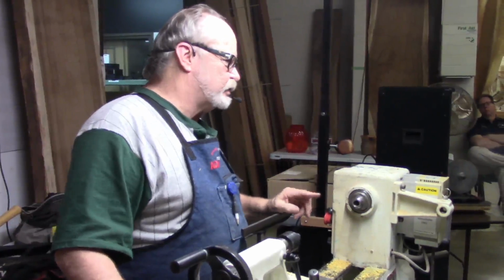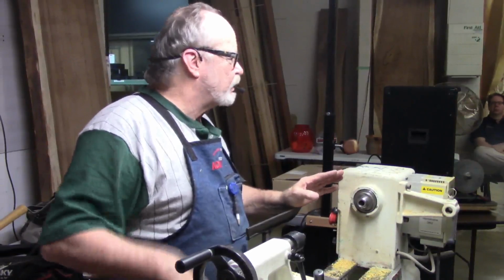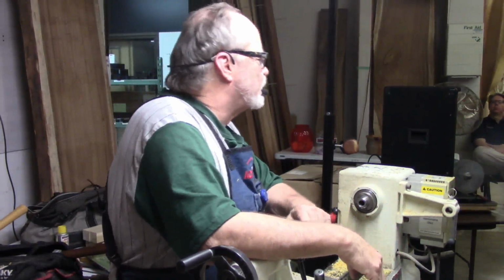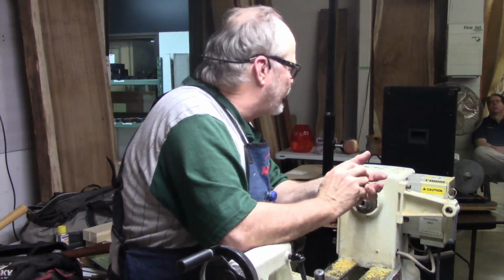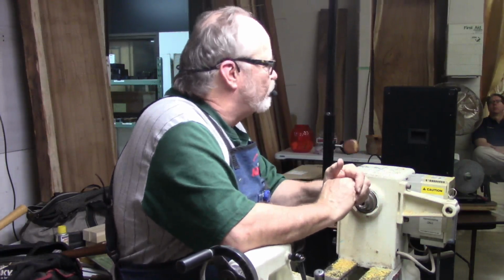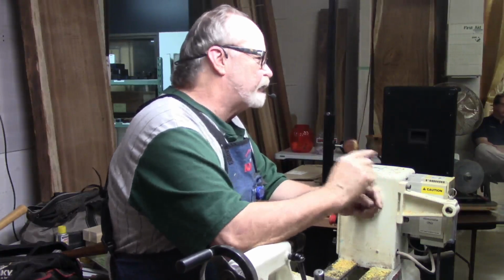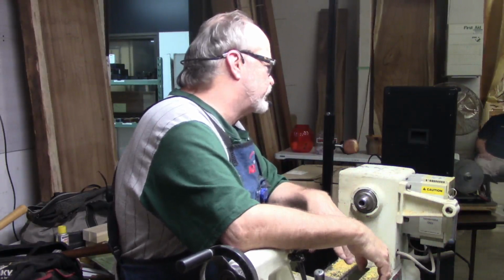It maintains the edge. I watched a professional bowl turner at a conference a few years ago. They asked him in the audience, do you hone your tools? He says, no, it's a waste of time. I watched him go to the grinder, put a jig on his bowl gouge, and he did that 3 to 4 times on one bowl. And I thought, that's interesting. I would have honed every time he went to the grinder, and I have a sharper tool. So who's wasting time at this point?